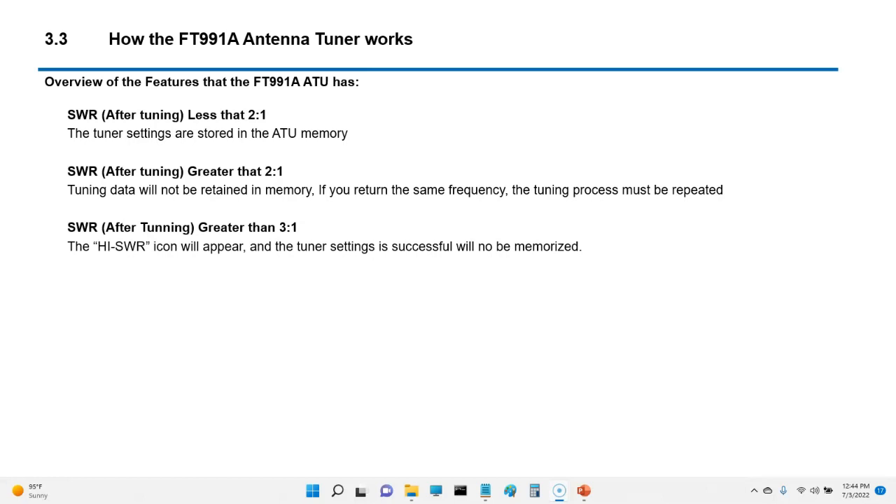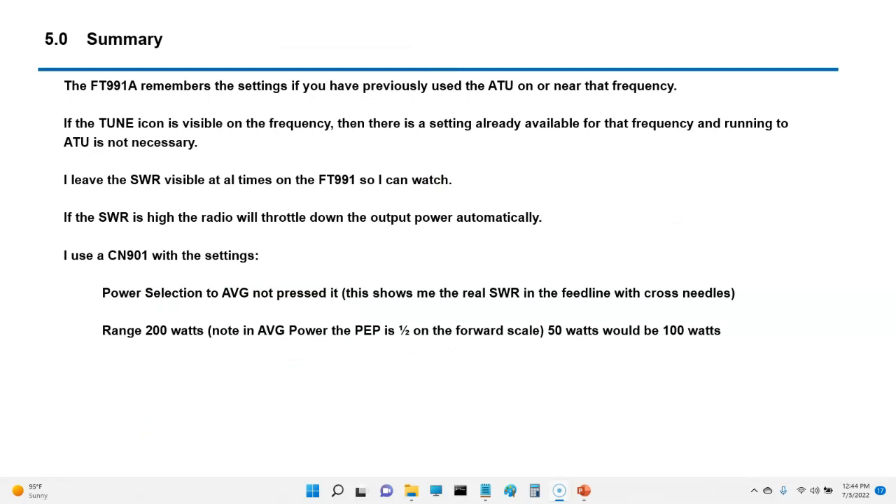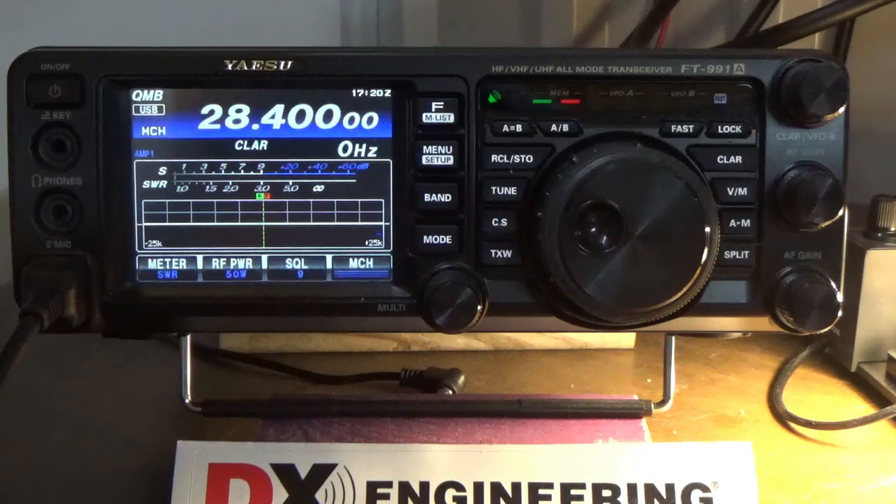For the most part, my experience has been that this tuner brings everything down, so it's not a big deal. This shows my CP610 running about 70 ohms on six meter. In conclusion, I leave the SWR visible at all times, and on the CN901 I leave the power at average, 200 watts.